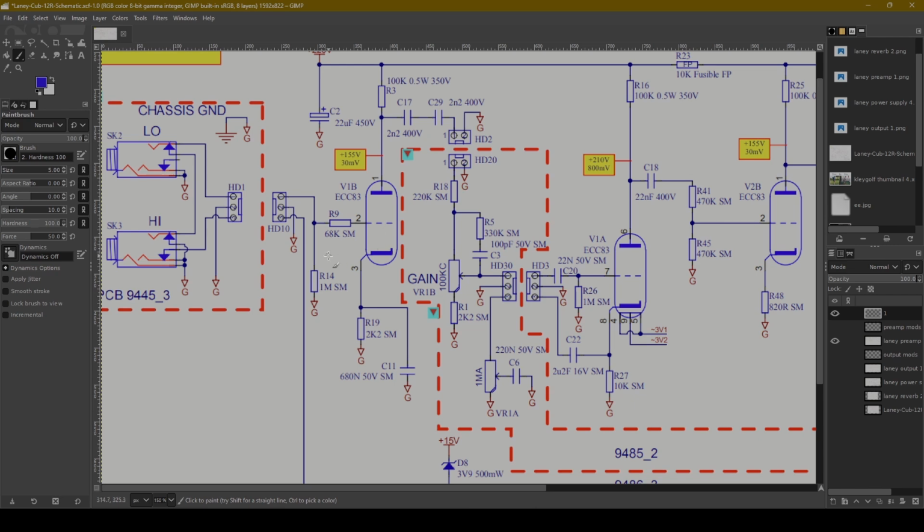and you actually want to set it so that it's like at 15K or 20K. Your guitar signal is not going to be functional beyond 15 or 20K anyways, and so you want to remove all that here at the input to help stabilize and clean things up. Perfectly normal and fine.